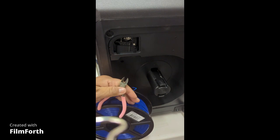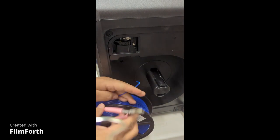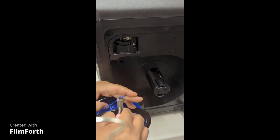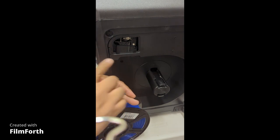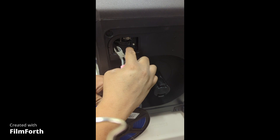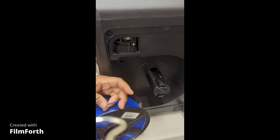If you got it separately from a Sketch printer, don't worry — if you have your own side clippers that's the same thing. You can get one of these or if you have needle nose pliers that have side clippers, this works the same way too. Just as long as we trim the edge of the end of it. I wouldn't recommend cutting it flat — I want to do it at any type of angle because that way it'll have a sharp end to actually insert inside the channel of the motor. That way it'll guide through into the tubing and into the nozzle itself.